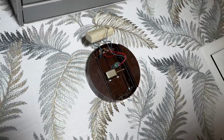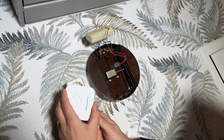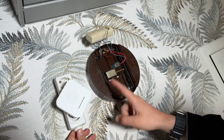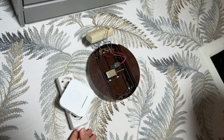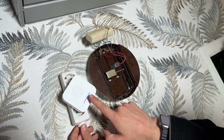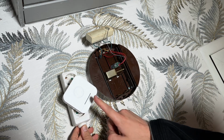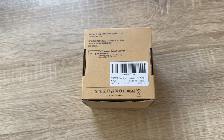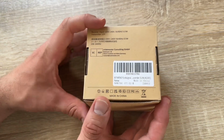Okay, you have the doorbell button installed in your house, for example. And if you push there, it makes ding dong or something else. Then you open your Gong supply unit, and there you will see 2 wires, okay? And on each wire, we have to connect one of the cables of the Bitiwend radio signal forwarding wireless extension set for doorbells. You can melt it, you can press it, you can use a screw for it or something else. And then the job's done. The receiving working voltage is AC 100 volt up to 240.